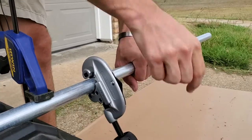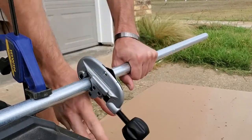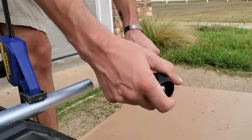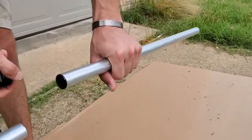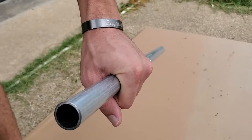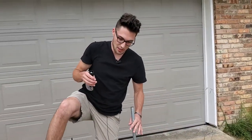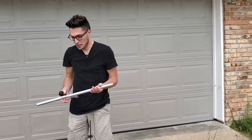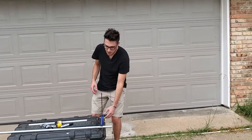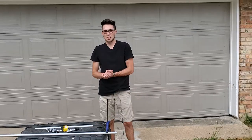You're just working your way toward the center of the metal. I'll provide a link for this specific cutter because it's the fastest one I found and super easy. You can see how clean the cut is — you do need to be careful of occasional burrs, but compared to angle grinders there's a lot less mess and it's very straight. That's essentially it — just do a bunch more pieces and we'll continue with the next steps.